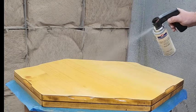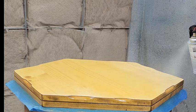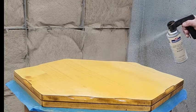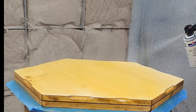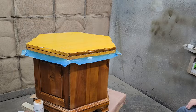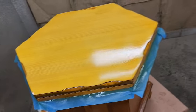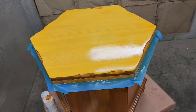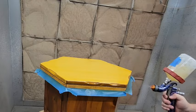The reason we go this route is that it'll let us creep up on the color until we get to where we want to be. I'm laying down a base of natural pine — it's a translucent toner. There are heavier bodies and lighter bodies, and as you can see it does not look like the right color at all. That's sometimes the harder part about this: understanding color.